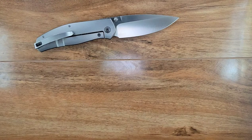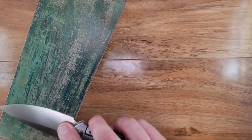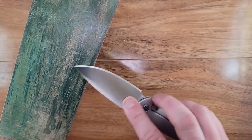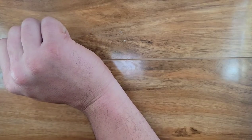Let me wipe this off and give it a quick strop because I didn't strop it after the last time I used it, so it would appreciate a quick little strop. I have much nicer strops made by Jake from Ohio, but I have them scattered throughout everything. Jake made me some badass strops - tried to get him to sell them because they're made with some awesome leather, but he's not looking to do that; it's just fun for him. I'm not using any pressure when I'm stropping. Just checking my work - making sure I'm shaving hairs off my arm. It's not the best test, not the end-all be-all, but it's my test. And it's sharp.